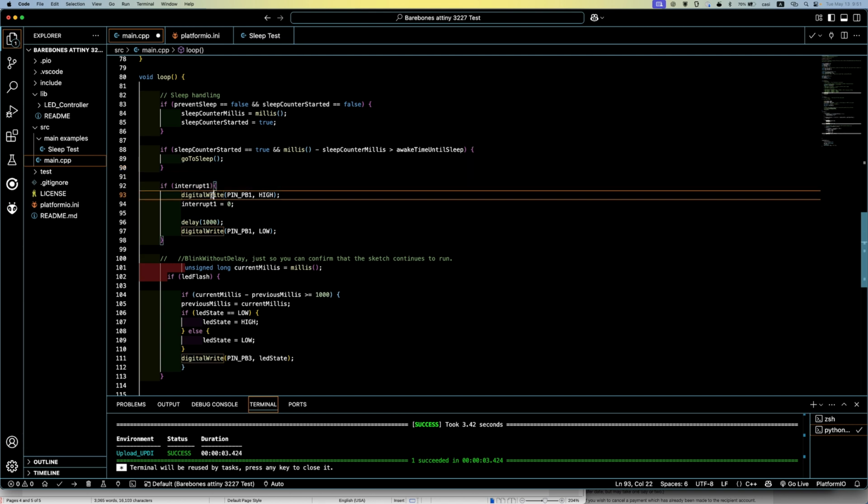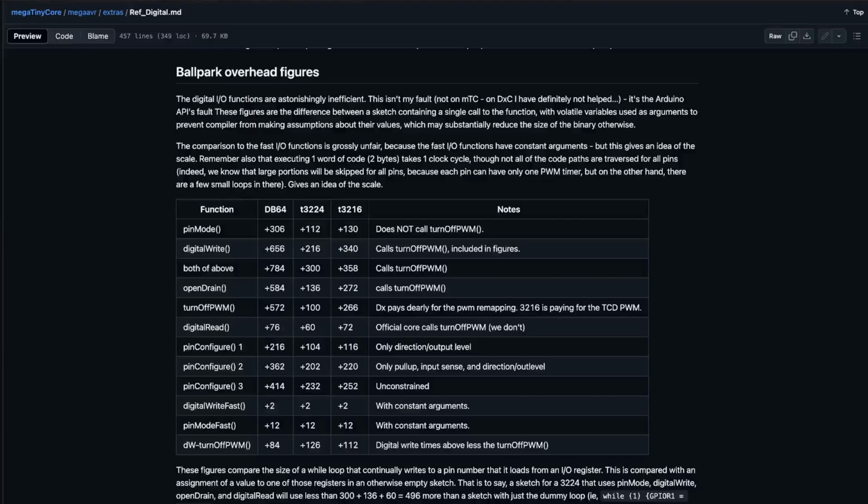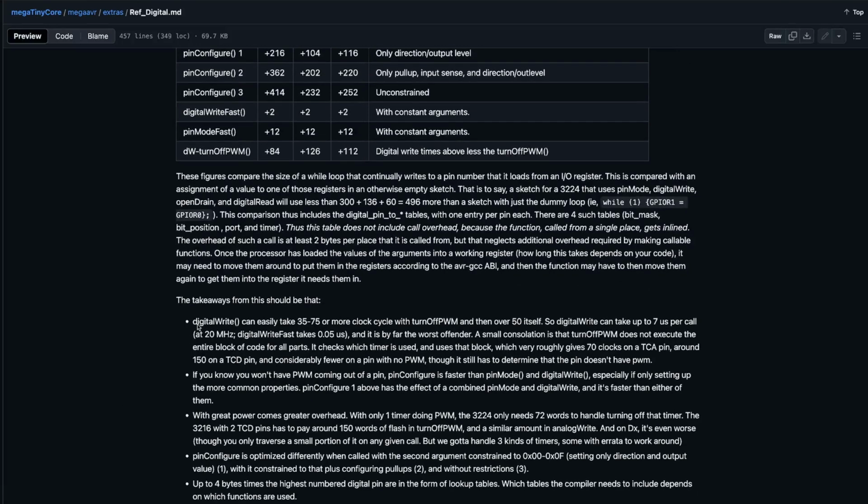So if you've used Arduino, and if you're watching this video, then like 98% you have, then you know of the illustrious digitalWrite. Well, did you know that it's not optimized? So with MegaTinyCore, they added something called digitalWriteFast, and that's at least 20 times faster. And they added this other stuff too, like digitalReadFast, pinModeFast, and lots of other stuff to dive into that just does away with a lot of the inefficiencies of the original Arduino core.